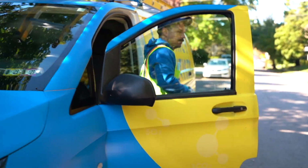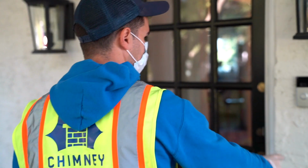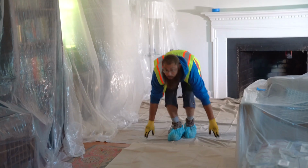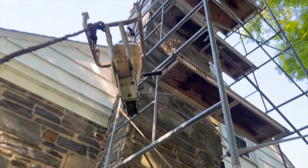When the lead technician shows up to your house to do a ceramic restoration, fixing the holes inside your chimney so that you can use your fireplace, the first thing they're going to do is plastic the area around your fireplace. Then they'll set up either ladders or scaffolding, depending on the accessibility, and they're going to bring this mechanical crank on top of your chimney.